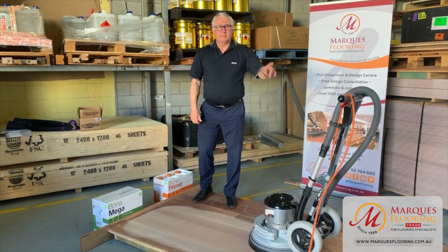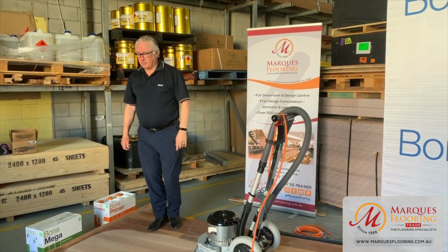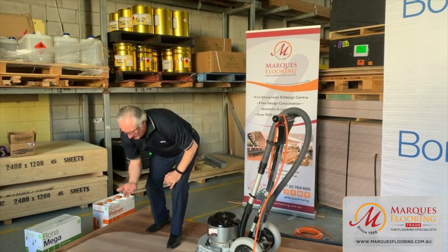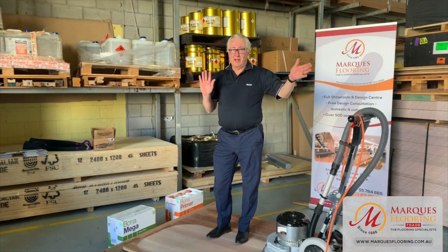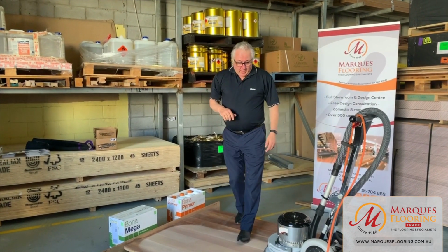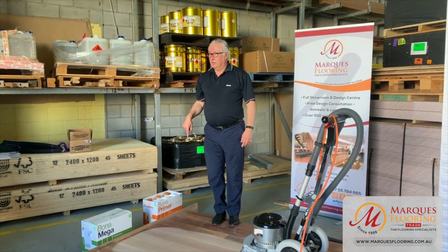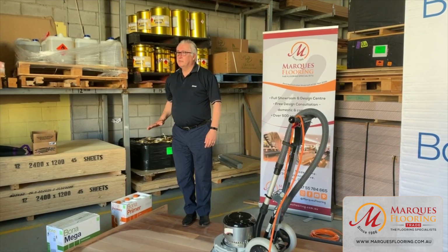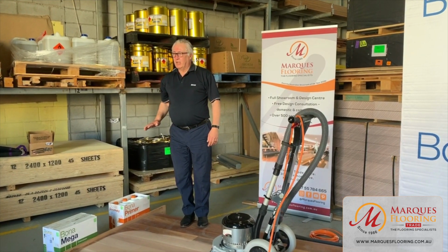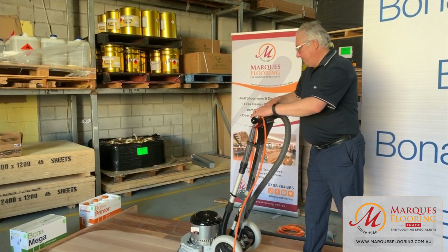The other thing too is thinking about the performance of the dust extractor, the DCS here. There's no dust on my hand. That's how strong and powerful that machine is. What we have here is an oil finish floor. All we have is 50 grit abrasives that have just taken that in one run. Not difficult at all. So I'll just continue on.